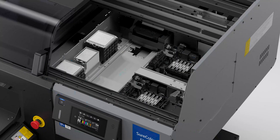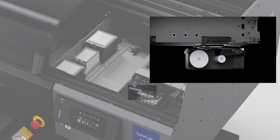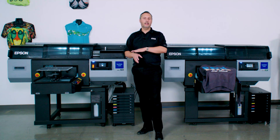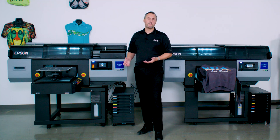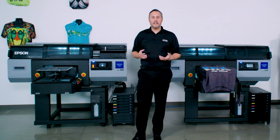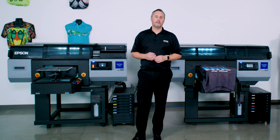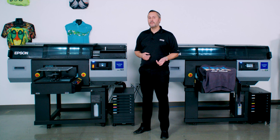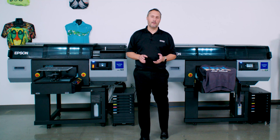Another feature is the maintenance cap, where we use maintenance liquid in the system, pumping it through the cleaning station to remove any buildup of ink or debris. We overflow those caps to move debris away from the maintenance station and collect it in a waste bottle. This helps the printer work in harsh factory environments. And speaking of environment, there isn't necessarily a need for a big humidifier or tight temperature and humidity window — this system works in quite a wide range, from 20 to 80% relative humidity and from just under 60 degrees to about 95 degrees Fahrenheit, wonderfully well without issues.